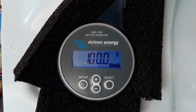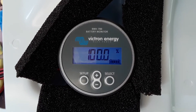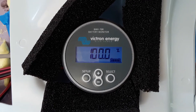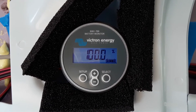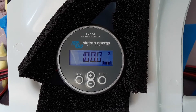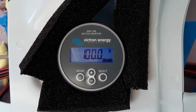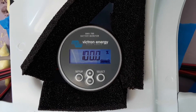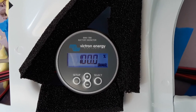100% charge on the batteries! With these batteries, I don't want to go below 50%. So we have to stop using electricity if we get to 50%. If you use lithium batteries, you can drain them a lot more, but it keeps the batteries healthier if you only go to 50% with regular batteries like AGM batteries, lead batteries, or similar types.